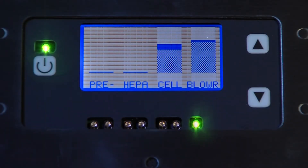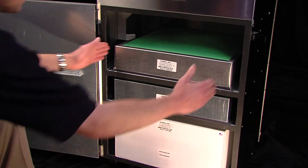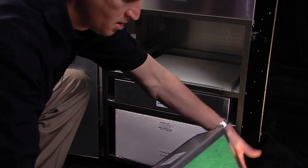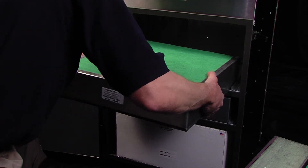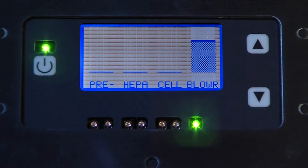When the electronic gas sensor detects saturation of the gas odor filter, amber alert lights will illuminate under the readout labeled CELL. The old filter will come out easily, and as with all FA-5 filters, only the full one — in this case the gas odor — has to be replaced. Simply make sure the label with the part number is right-side up and readable, then position the gas odor filter into place. When the FA-5 is restarted, the front display should indicate no problem under the CELL readout.